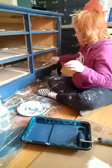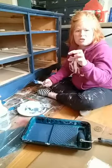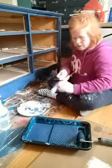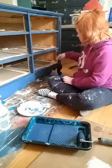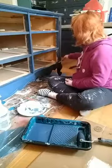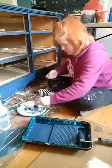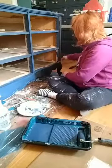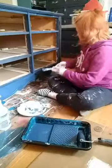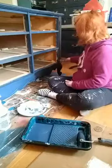If you have a blue t-shirt you cut up, and you have a piece that's white or cream, the blue dye from your t-shirt could go onto your piece as you're waxing and pushing. So if you're working on a really light color, use a white t-shirt for the buffing to take off all your wax, so you don't have any chance of the dye going onto your piece of furniture or your cabinet doors. But of course, if you're doing something like this, a blue-gray, I'll just grab a blue t-shirt and cut it up and do my removing of the wax with a blue t-shirt. That'll be okay then.